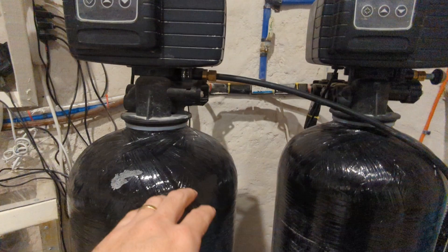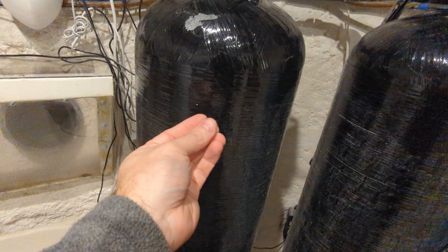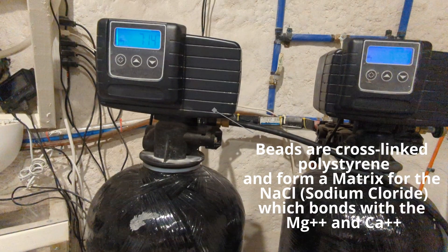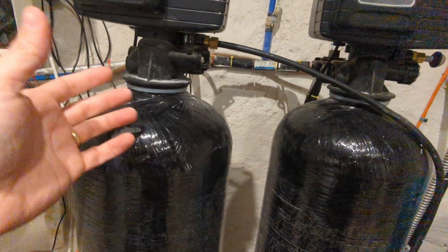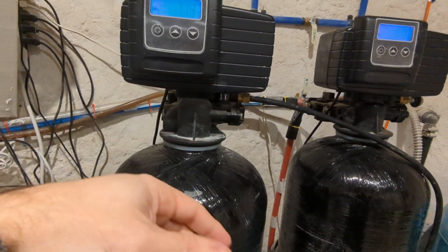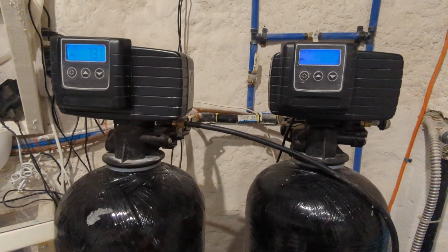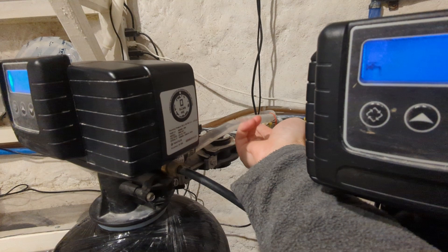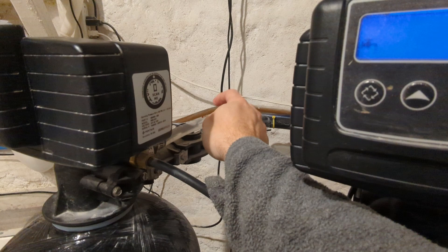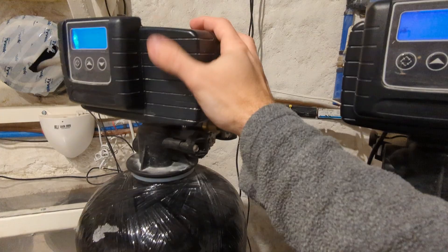On this side is the hardness filter. The calcium and magnesium in my water go through here, and there are beads inside that attract those minerals. Those molecules stick to the beads in the media and build up over time. Once every programmed number of liters, it runs the backwash cycle. Backwash first just cleans the beads - it runs water backwards through the system and dumps it out this hose, which is nice and clear because by the time it gets here there's no rust in it. That washes out the sediment and junk - that's the backwash phase.